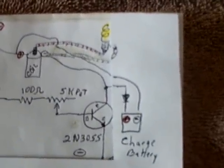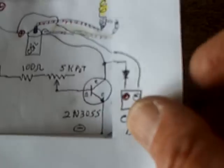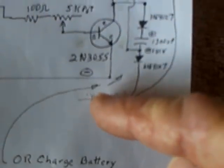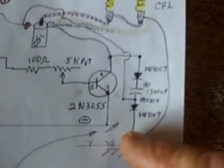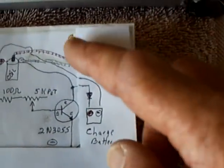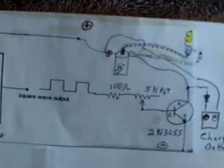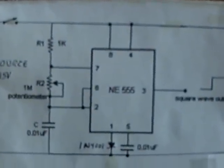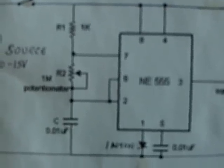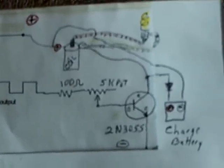This solid-state circuit with the 555 timer, I just put it right into a charge battery. Now in the last circuit diagram, I had this going into a capacitor then into an earth ground, which still can be done, but for the mobile boxed version of this circuit, I decided to simplify it and just do it like the normal circuit — into a charge battery coming off of the negative of the coil. The 555 timer circuit is right there. You can freeze frame this and probably read the values. It's very simple, just going in a square wave pattern into that transistor.